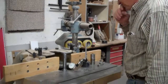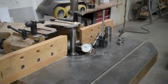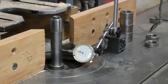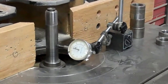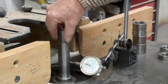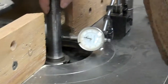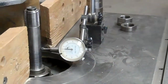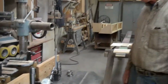You can watch. Once it's stopped, you can see exactly how much run out there is. I think that's important with a shaper, especially when you're swinging a large cutter as this one will do. Two to three thousandths there — that's about the thickness of a hair.